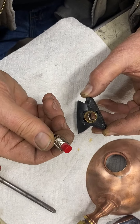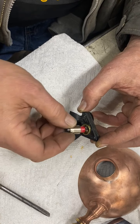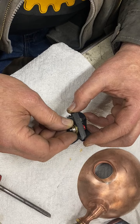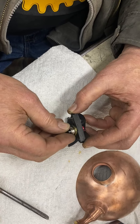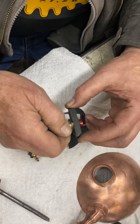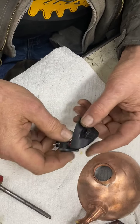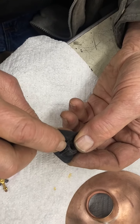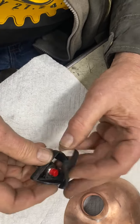If we went back to the original plastic, this bronze sleeve doesn't need to be there at all. We could put this exact three-eighths fine thread — 24 TPI or tighter — and just thread that right into the plastic, doing away with the entire bronze sleeve. This screws in here like this, and we have a tiny Phillips head screw inside so when we lower it into place...